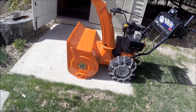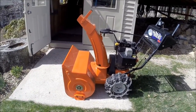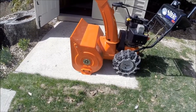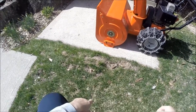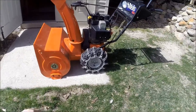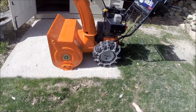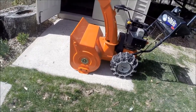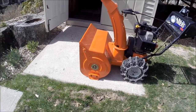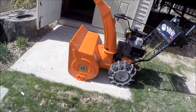If you're using this on pavement, the scraper blade really should be set to about one-eighth of an inch, or whatever your manufacturer says to have that set at. I see a lot of guys start raising that up and also raising up the runners. If you raise it up too much, you're going to leave snow behind and your tires are going to ride on that snow and start losing traction. So that should be set for about an eighth of an inch on pavement. If you're using it on wood chips or a stone driveway, that's another story — follow the manufacturer's suggestions.